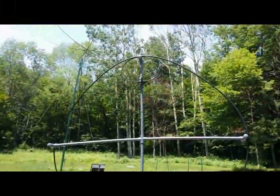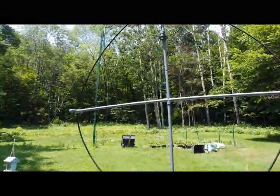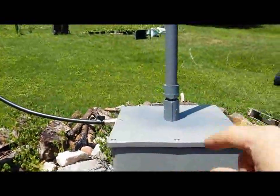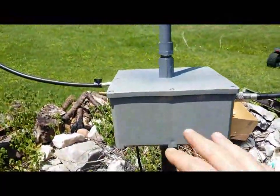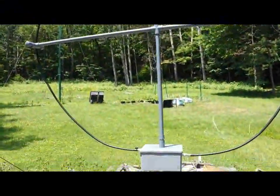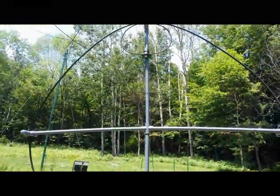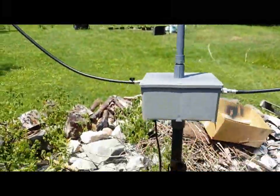That's what she looks like erected. I have it on an old light stand. You can see the coupling loop up there. It's basically the PVC framework socketed on the little lid of the box — half-inch — punch a hole through, take a plug, thread it into the back side. It doesn't need to be up really high. I've seen a lot of people place them on the ground, but from everything I've read they recommend putting the loop about one loop diameter off the ground. That's what I do — seems to work really good. The coax feed line from the radio jacks in there.